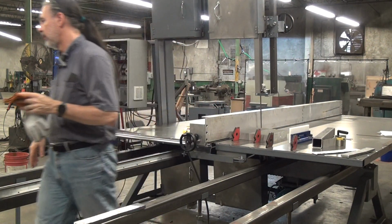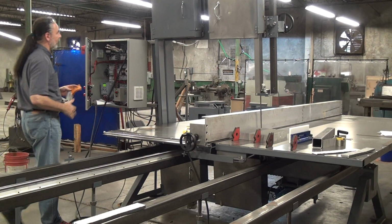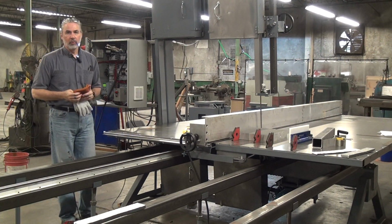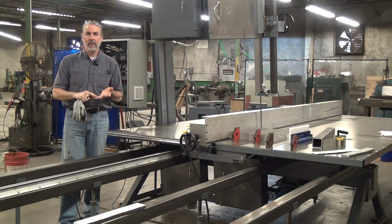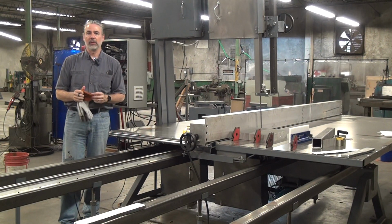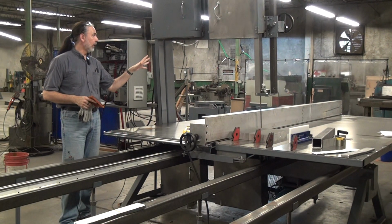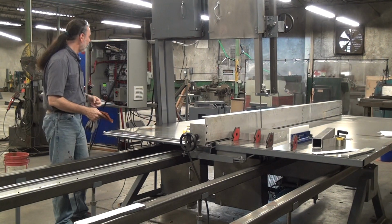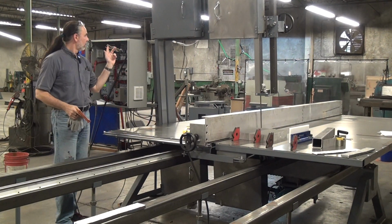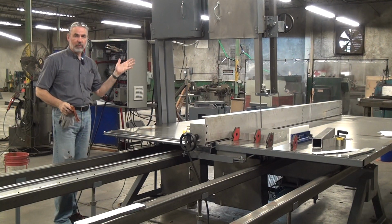Controls. This machine has our pneumatic blade tensioning. It's pretty much all of our big saws like this do. Pneumatic blade tensioning replaces what you normally might see as a screw over spring mechanism on a smaller saw. Those are reliable as an anvil, and everybody understands how they work. But for a big saw like this, they get really inconvenient, particularly when we're running a big blade. So we have an air cylinder in the back being used to tension the blade. It's controlled by an electric solenoid valve on the back side. It allows us to do a few things.